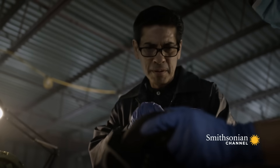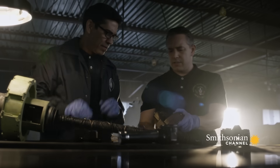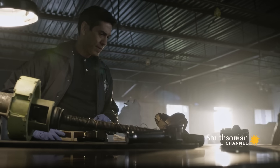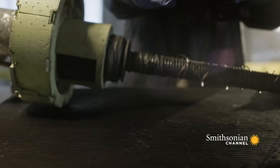There's something unusual about the nut — it's completely stripped. When investigators finally looked inside the acme nut, it revealed that there were no threads inside of it. It was shocking and stunning to see something like this; no one thought that those thick threads could rip out.